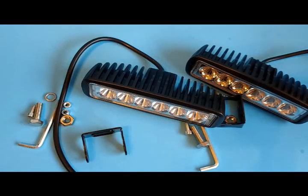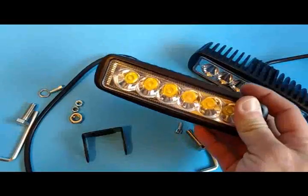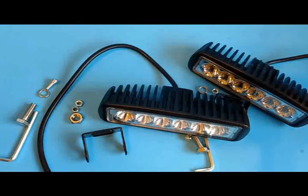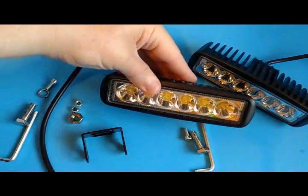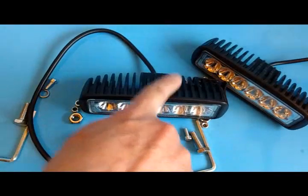It's more prone to scratching than conventional inorganic glass, but modified PMMA is sometimes able to achieve high scratch and impact resistance. There's nothing that indicates this is modified PMMA, just a PMMA, polymethylmethacrylate lens. Anyway, there's the lens. Supposed to be shatter resistant. Again, the casing is dyed hard aluminum.